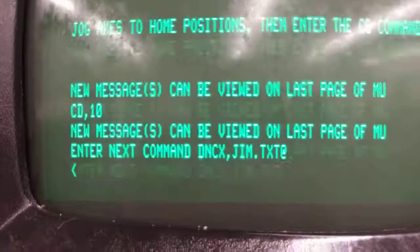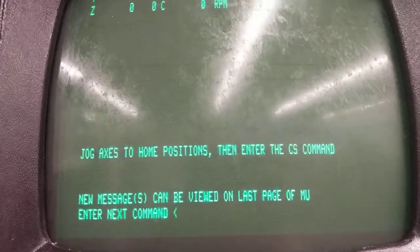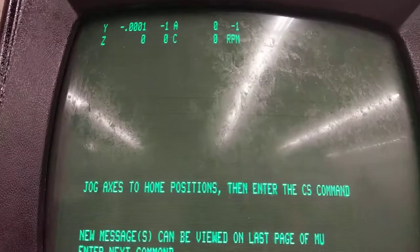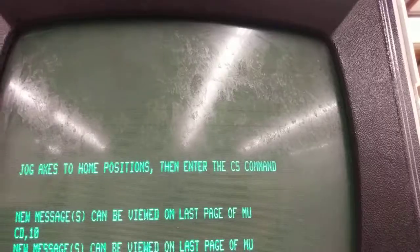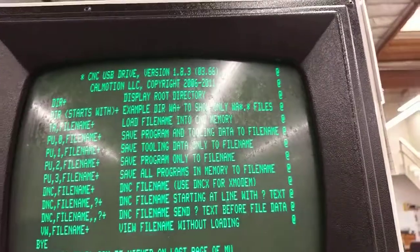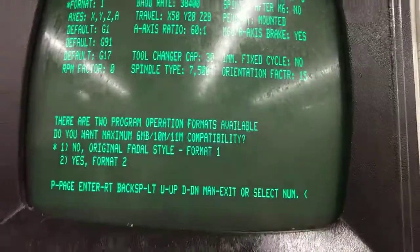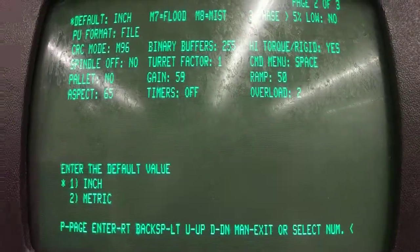Those are some good tests to diagnose installation problems. Check your baud rates, make sure your black wire is on the common, and make sure you can get the help menu by typing CD,10 enter and then plus. Once you get that, you're on your way. Also make sure your baud rate is available for CD,10, and that your command space is set to space or off.